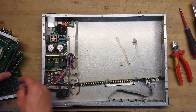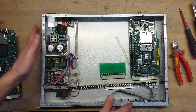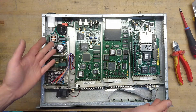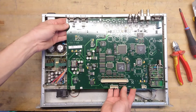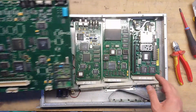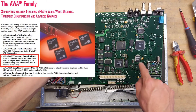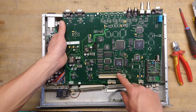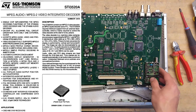I got more than one unit of each — the small black one and the large gray Tanberg. Putting boards back in place, I took another unit of the Tanberg apart and it was completely identical on the outside, but it just had one single board on the inside — quite a substantial difference in design. This one has multiple boards each doing their own job. Here we have what seems to be a demuxing chip, some receiver circuitry along with a Broadcom IC probably handling the satellite receiving, a Xilinx FPGA, some other ST parts, RAM, controllers and such.